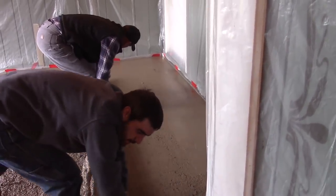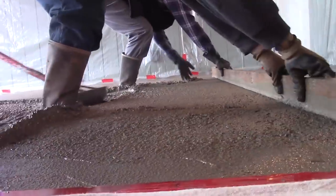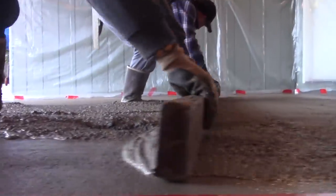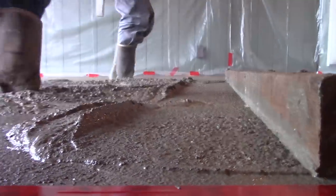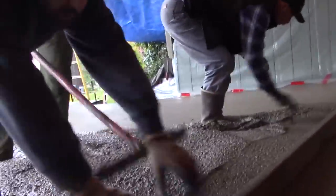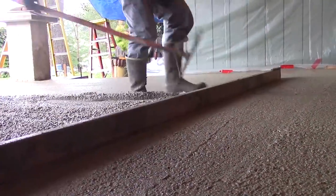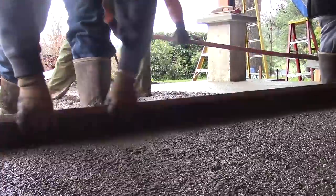Now think about doing this while you're working at your ankles. Now think about doing this while you're pulling concrete with that rod. Maybe it's 10 pounds of concrete. Maybe it's 30 pounds of concrete. Maybe you've got an inexperienced mud cutter or an apprentice or somebody, or maybe a homeowner who thinks he's going to be helpful, and he's getting behind on cutting the mud, and you're dragging 60 or 80 pounds of concrete on a wet rod. You got a problem. These guys never have a problem. They are seamless, and their product is flat, and it looks great when they're done.